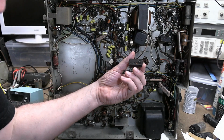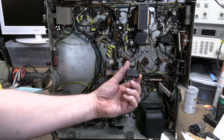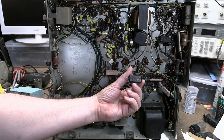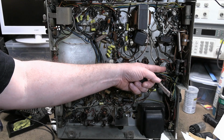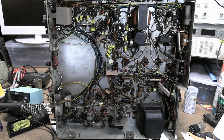So, mica mold. We have green, black, and orange, which I surmised, and still surmise, means it's 50,000 picofarad or 0.05 microfarad. Now it's going to a 6AC7, or was, till I clipped it out, right here, which I think is a second video amp. On the schematics, though, they show a 0.047.